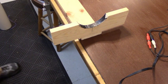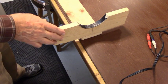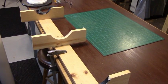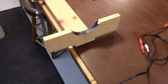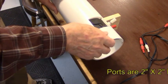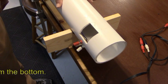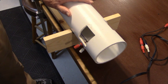We're going to now assemble our speaker. I want to show you this pipe jig I built — it's actually a couple of pieces of pine nailed to a 1x4, and there are three cradles you can use to lay your pipe in. If you're going to do any pipe speaker building at all, I suggest you build one of these; you can clamp it right to your table and it makes assembly a lot easier. Now we're getting started with our 38-inch PVC pipe. I've cut the 2x2-inch ports equidistant around the pipe, I've also installed the banana plugs, and the wiring is already run up through the tube. So we're ready to assemble the first part of our speaker.